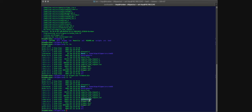Firmware. Okay. Now, what you need to do at this point is take this file, FTP this file to another micro SD card, and that's the card that you insert in the Manta board. A different card from the operating system where we are, okay? Because this will contain the firmware for the board. Now, there are a bunch of other options that you need to figure out. The serial, that's in the configuration, you need to figure out, that's in the manual. I will do it later. But at this point, you're basically good to go.